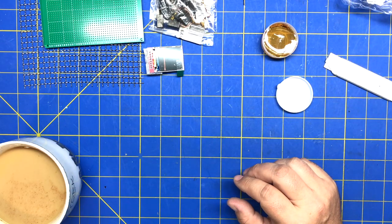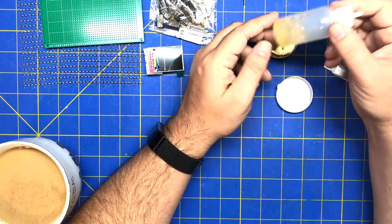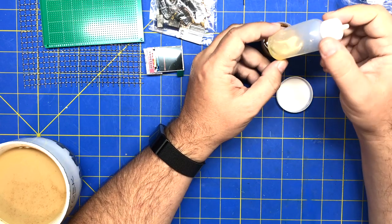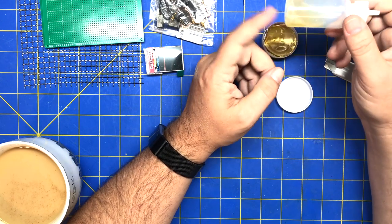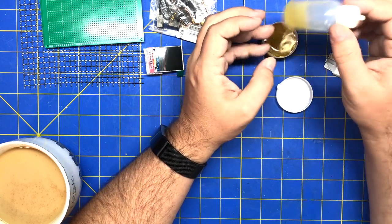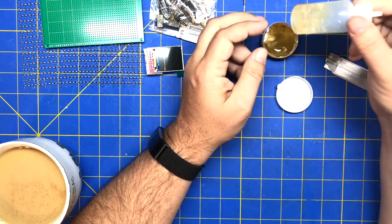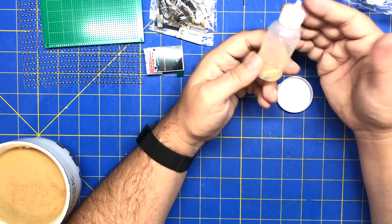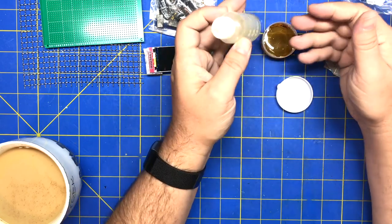And you can make your own solder flux by just dissolving some rosin in IPA. Or something even more pure, like ethanol or something. But IPA is probably safer. You know, it does have that 1% of water or whatever is in there. So you can probably use 70%, but if you can get the 90-something percent isopropanol and then dissolve that in there. Some people use vodka or ethanol, or I guess I could use some moonshine, to leave less haze on your board. So I thought I'd try that out. Just see about making your own flux. You can control exactly what you want.